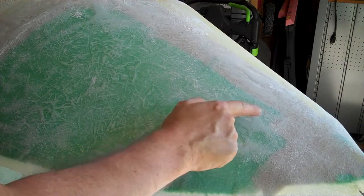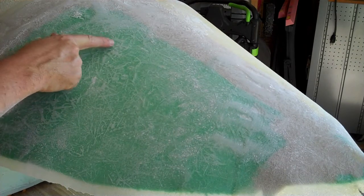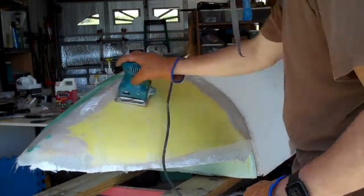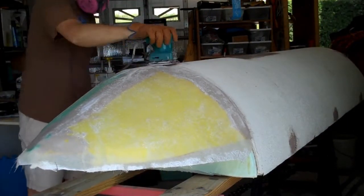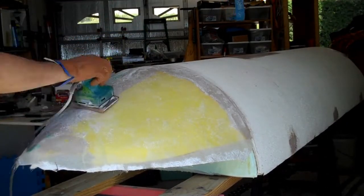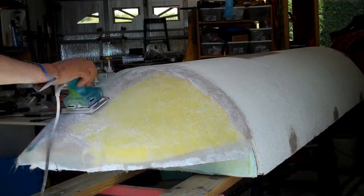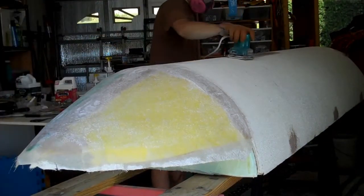You can see the high spots where the dust collects in the low spots. Where it used to be completely smooth, the individual strands that were high have been turned kind of a whitish color, but there are still glossy clear areas between them. I'm going to be sanding this until most of it looks something like this, where there's not as many glossy areas. After putting chop strand mat on the cylindrical part of the pontoon, I generally just do a single light sanding pass to knock down any fibers sticking out and scuff the surface for the next layer. However, the nose cone has compound curves so the chop strand mat will sometimes have small wrinkles which require more intensive sanding to level things out. I wear a P100 respirator when sanding or vacuuming fiberglass.